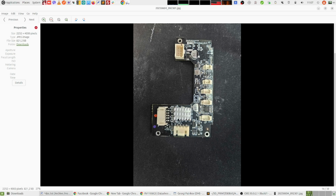First, the board, that I have nothing I can do right now about it. And the other theory was that something is causing noises in the cable, in the serial communication between the printhead board and the motherboard. And as I told you earlier, here we have 8 pins, only 7 of these are used, and 4 of the pins are two 24-volt lines that are coming from the motherboard. And the other 3 pins are for the serial communication between the motherboard and this board.